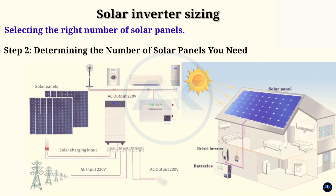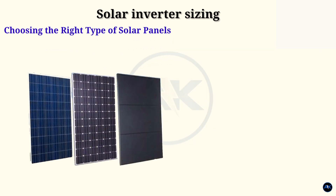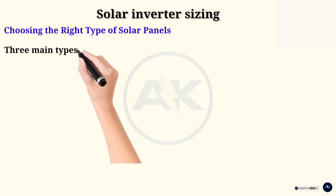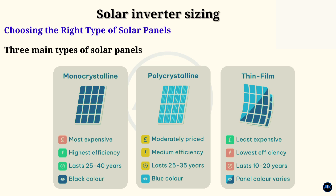For example, if you require 15kWh, your solar array needs to be large enough to produce that much energy. A 4.5kW array — or 10 x 450W solar panels — would just about cover your consumption. The type of solar panels you choose can also impact the size of the inverter you need. The three main types are monocrystalline, polycrystalline, and thin film. Monocrystalline panels are the most efficient but also the most expensive. Polycrystalline panels are less efficient but more affordable, while thin film panels are the least efficient. Almost all commercial or residential solar installations use either mono or polycrystalline.